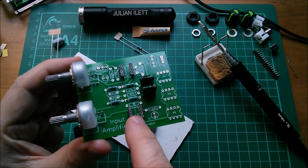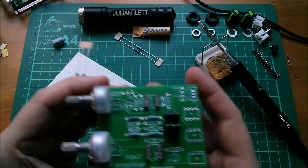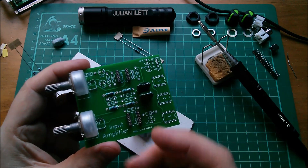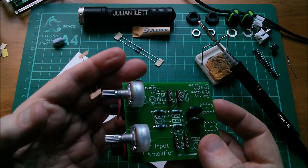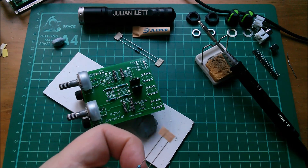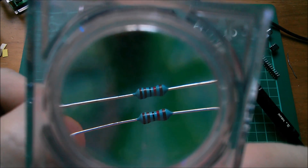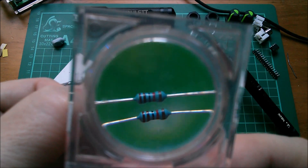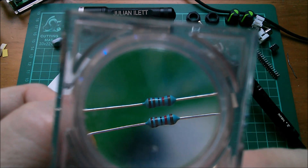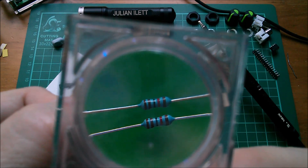Right, let's fit the 11k resistor. I remember going to a lot of trouble to find these 11k resistors — I think in the end they came from Rapid Electronics. There are only two in this entire project and I've probably got a hundred of them. Let's have a quick look at the bands for 11k: of course it's brown, brown, black, red — so 11 and the black red is k because it's zero zero zero.